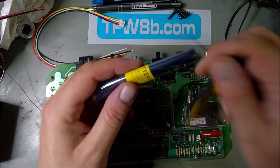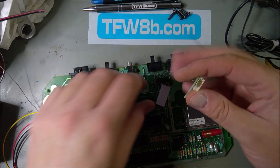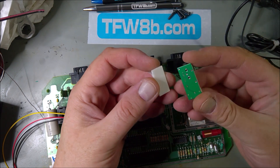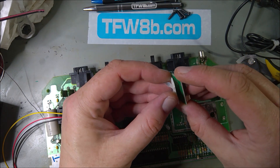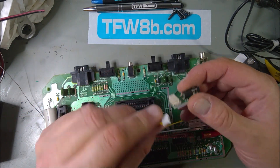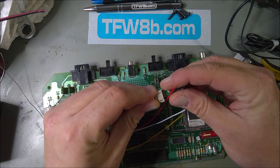So there should be a PCB in here. Take the PCB which is doing the work of making composite video. Put this little foam pad on it — this does two jobs: it isolates the PCB and sticks it down. Use hot glue if you like, it's fine. Good idea to connect the connectors now — they only go in one way.